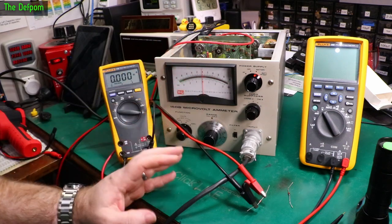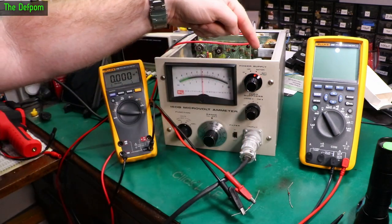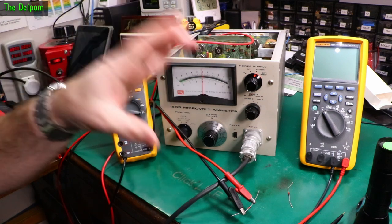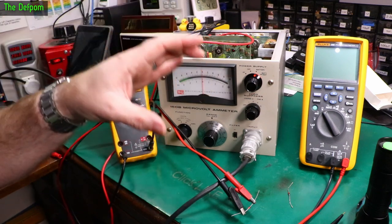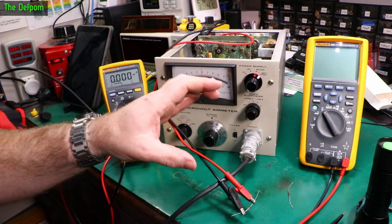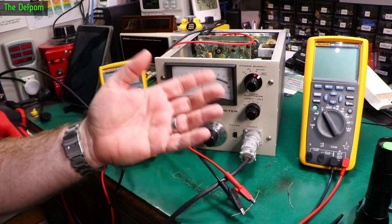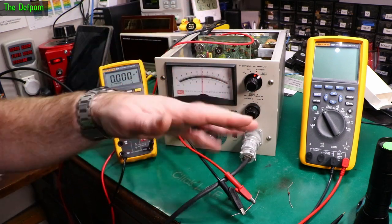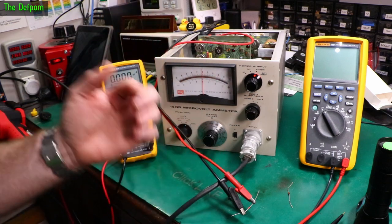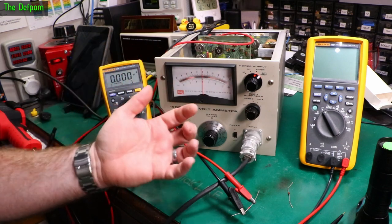There's always options. So my current plan is to have a zener across the output from that resistor, which would normally go to the battery, right? So that's going to drop the voltage down slightly, make it safe for the regulator. Then I can have the regulator going to a current limited system, like a 100 milliamp current limit. So I've got a little board which I designed a while ago. And that's a 100 milliamp current sink or source, however you want to approach it. It goes in series with a supply rail and it limits it to 100 milliamps.